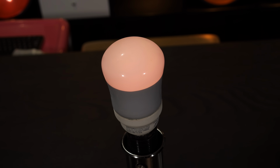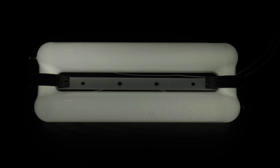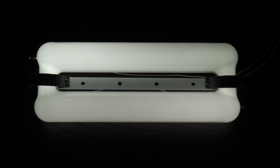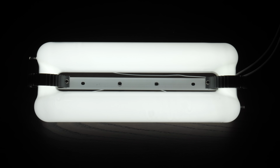Induction technology also solved one of fluorescent lighting's little annoyances: a slow warm-up. High-efficiency fluorescent tubes in particular only produce a fraction of their light output at first due to lower vapor pressure when cold, and thus they can take several minutes to warm up. This lamp also starts with a lower vapor pressure, and thus reduced light output, but the warm-up time is just a few seconds. And the large external coil lamp is similarly quick. It's at full brightness in only 10 seconds. You can actually observe the mercury discharge migrating away from the amalgam pellet as the tube heats up and the pressure builds. But, well, that was at room temperature, and these lamps were sold to go outdoors.